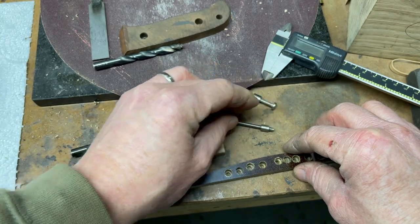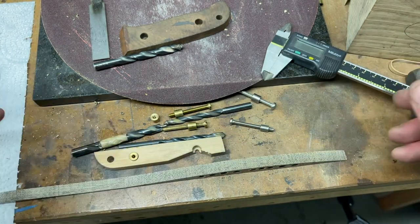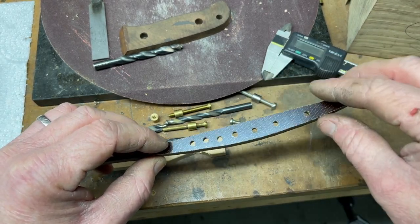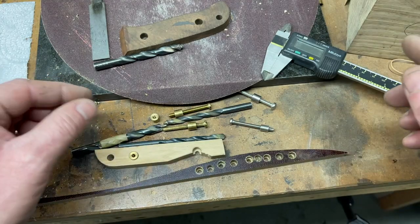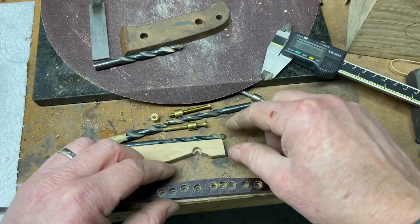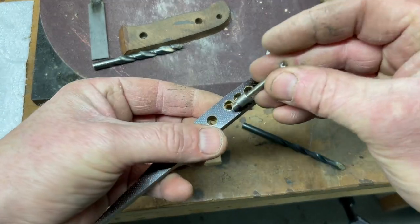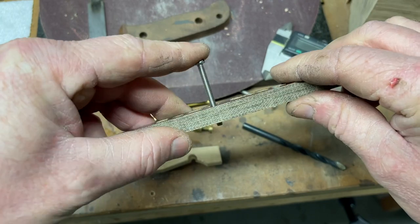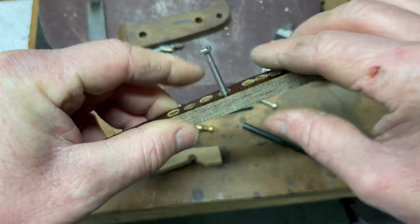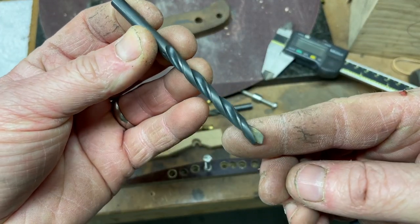The first thing you do before making your step drill is to get some scrap of your handle material and test the different drill sizes. I've got a box of drill bits that goes up in 0.1mm increments so you can really fine-tune the fit. If you have it too tight you won't get the bolt in and you won't have room for any glue. What I've found is 6.5mm seems to work about right — it creates a nice little socket for the nut to sit into but also leaves room for epoxy. So we'll take this 6.5mm drill bit and turn it into one of our step drills.